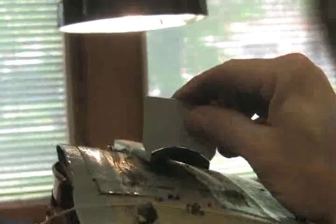So I'm going to continue until I won't see any more light, taking down any high spots that I make reference to as I check with my radius gauge. I'm pretty close — the rest I can take out as I sand. So now I'm going to check my relief because that's changed the relief. I'm going to check the relief in three different spots: the center and where the two strings fall on the outside. The rest of the relief will fall in place as I plane.